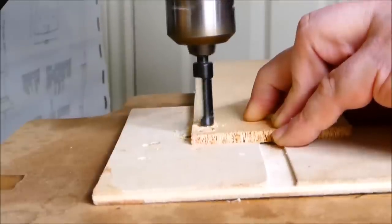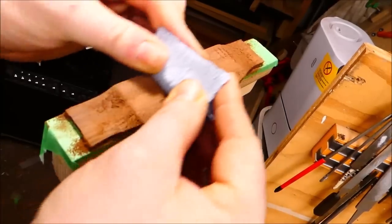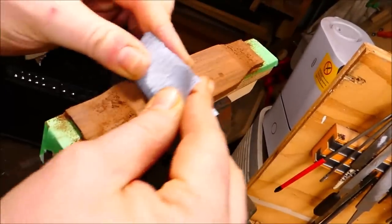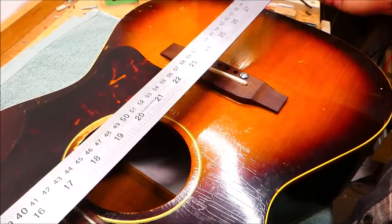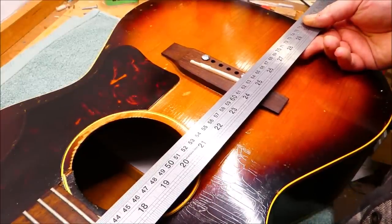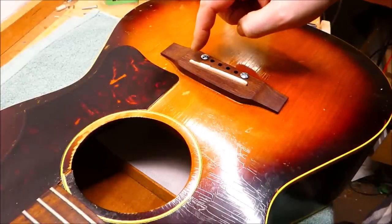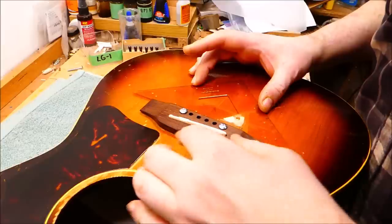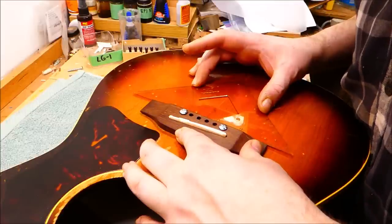I'm cutting some spruce plugs to fill the bolt holes in the LG. Don't have to worry about damage from the saw here because the whole surface is going to get scraped. On the Hummingbird bridge, I'm going to sand it and get the profile the way I like it. Just checking out the saddle placement — just a little bit short on the high E string, and just about right for the bass side. So routing that saddle slot a little bit wider is going to help because I need some extra compensation for the high E. Judging from the previous outline, the original bridge was not really put on at a perfect right angle to the center line, which is okay I guess.